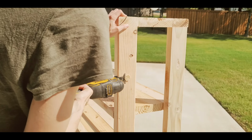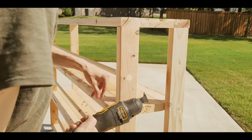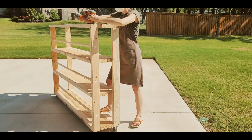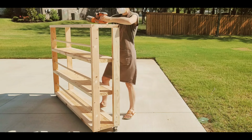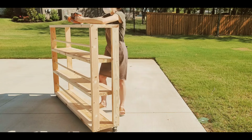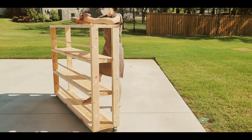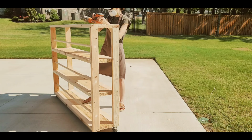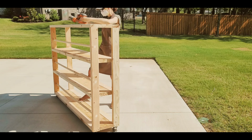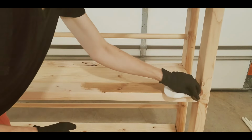So you get your wooden dowels in there, just twist and push, and then go ahead and use that multi-tool once again to smooth off the ends. Once everything is in and done, go ahead and sand it. I sanded with 80 grit, and then I directly went to 220. I only used 2 grits because the wood was quite rough and it was more of a rustic piece, so I wasn't worried about the smoothest finish I could do.